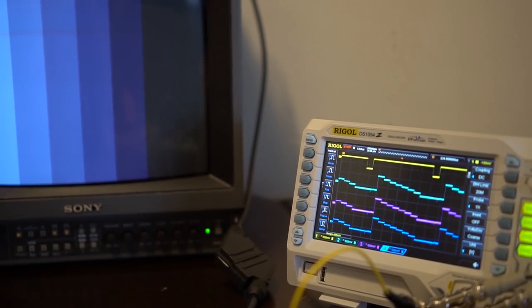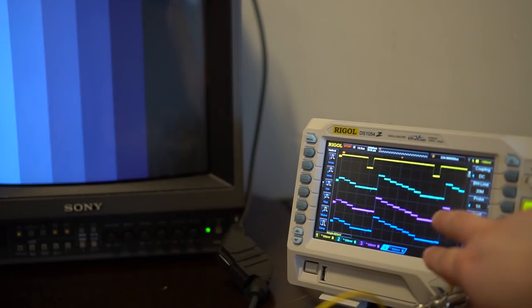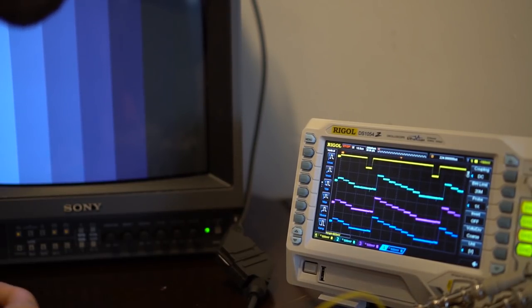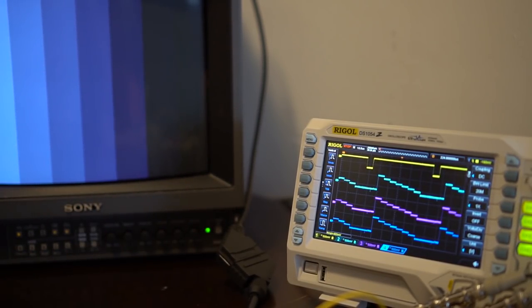If I go to gray — gray is equal R, G, and B values. Any grayscale is the same for red, same for blue, same for green — that's why it shows up identical on all channels. This is a ramp down of values. So the sync signal stays the same since it's just synchronization, but all RGB channels look identical because it's a grayscale ramp. Anything from black to white is going to show up the same on all channels. It seems like you've got a little contrast problem on your monitor — you can barely see the difference between steps. Yes, that's because Jose hasn't recapped the monitor yet. We'll do a before and after after the capacitor replacement — you could actually see it on the oscilloscope and on screen.